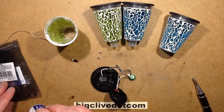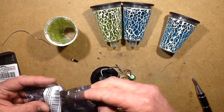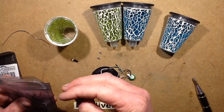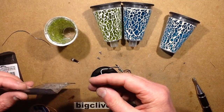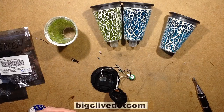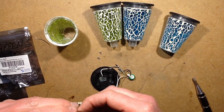It's very good for single-sided boards, not so great for double-sided boards because the solder tends to get stuck inside the plated through holes, and you have to apply other techniques or use vacuum desoldering pumps.